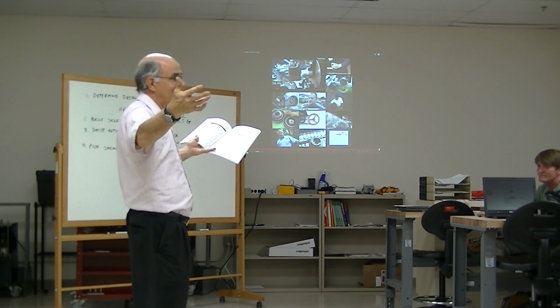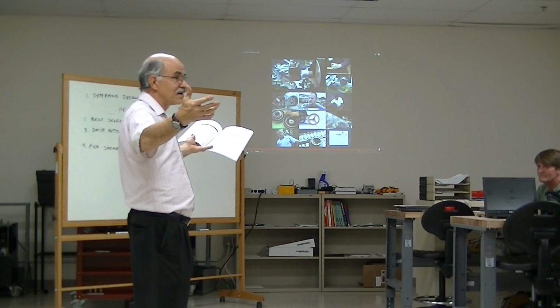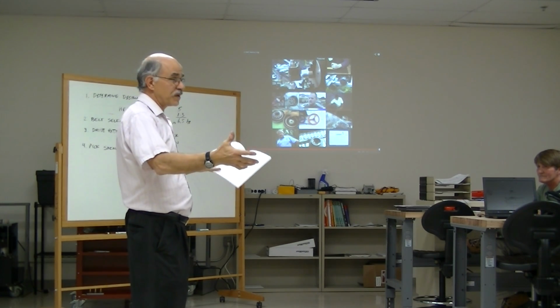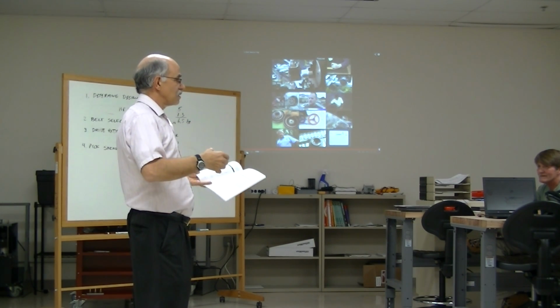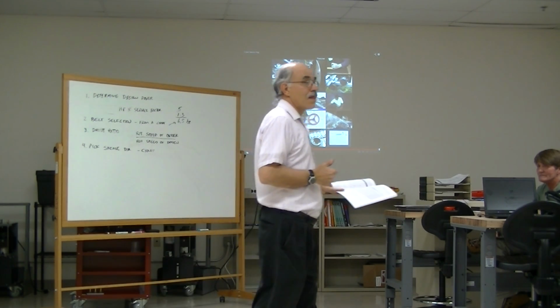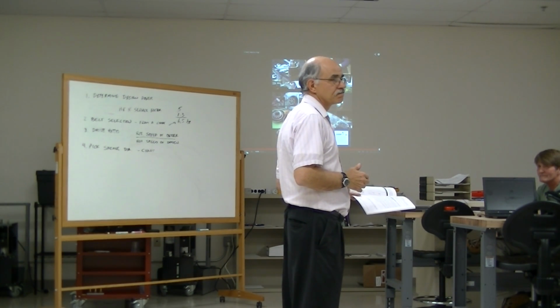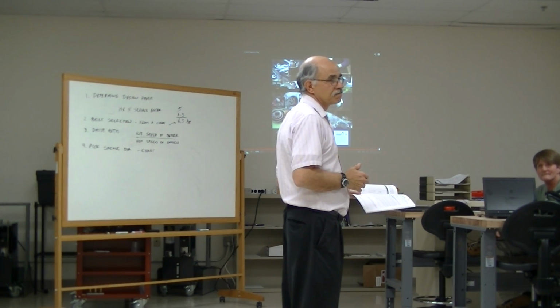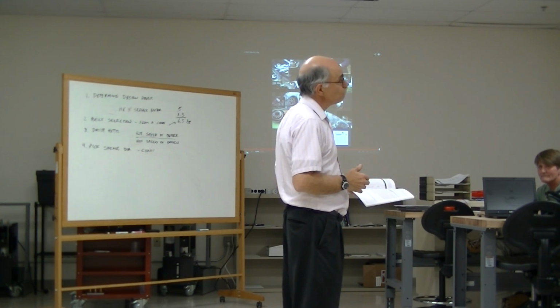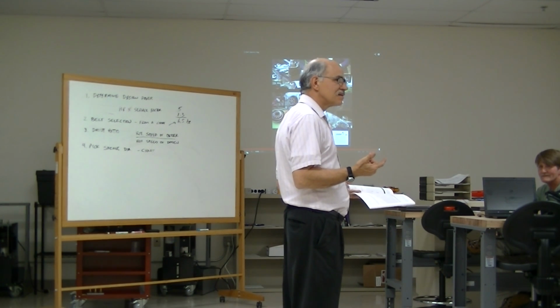Why not? Who cares what size the sheaves are? Why not use a big one? Because it would change the speed and torque. Well, as long as I got the speed right, who cares whether I use a big one? Space might be a possibility. What else? Horsepower? No, my horsepower is going to be good. Start-to-stop applications change how much attention the driven end gets. But wouldn't that be a positive thing? If I had a bigger sheave, I'd have more contact. Yeah, but you also get more centrifugal force.